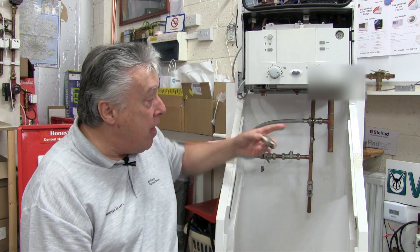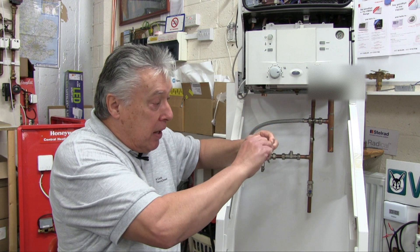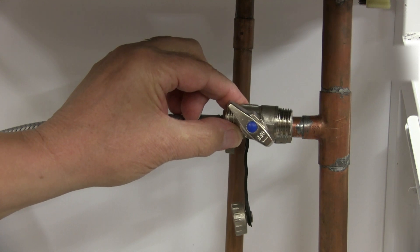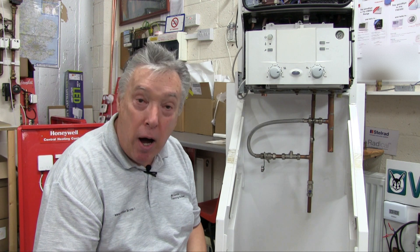The way to resolve it is by changing that valve into this isolator, which again exactly the same as this one can just be turned on a little bit so slowly the system pressure rises to one bar. That's the new setting — this is for three bedroom semis or smaller. Anything above three bedrooms the pressure is now 1.4.